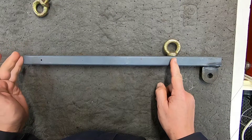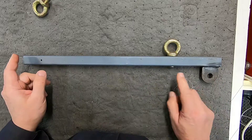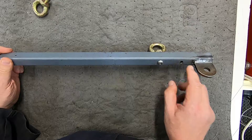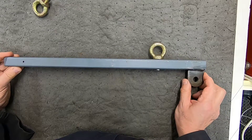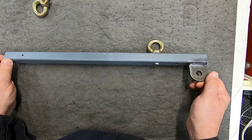It's 500 millimeters from here to there and another 100 from the center to there, so it's clearly a lever. The idea is to have a 5 to 1 ratio. There's also an extra hole here which is at 50 millimeters, which would be a 10 to 1 ratio. I didn't make any video of making the thing because it's trivially simple — just welding a tab on something and drilling some holes.